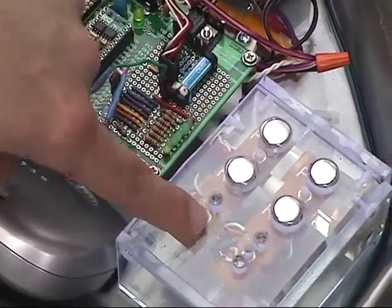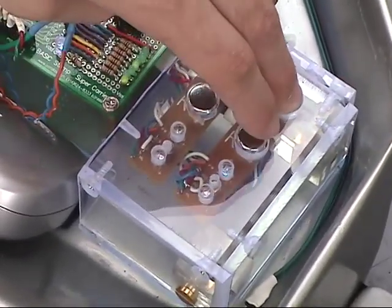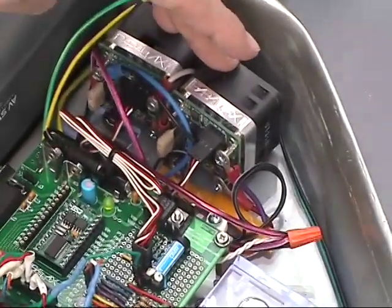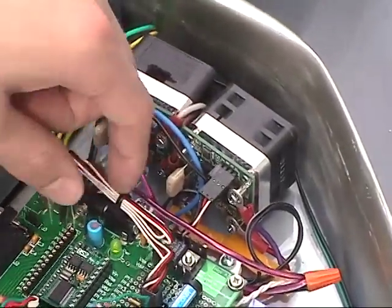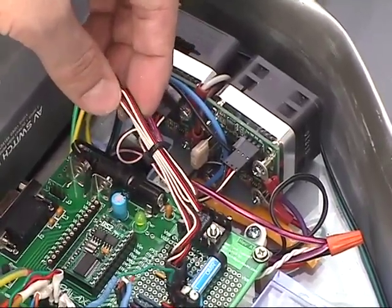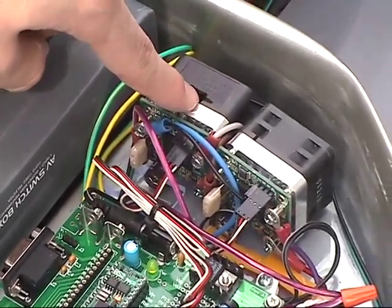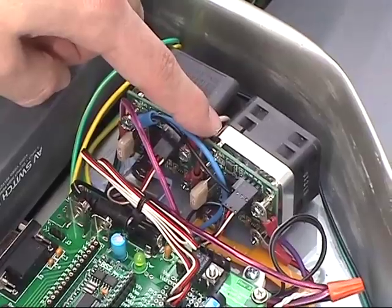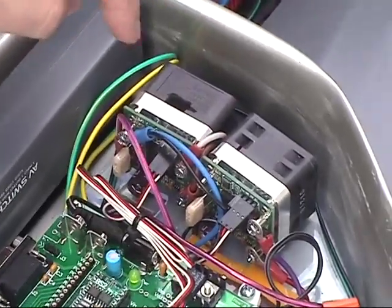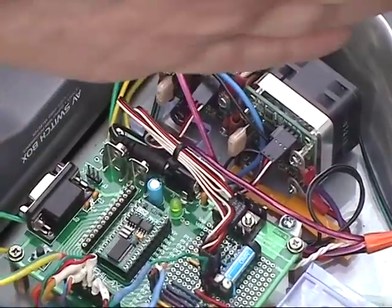I have LED feedback on those, so that when I move this here, you'll see the red light is flashing — and here the blue light is flashing on the way up. These are Parallax HB25 motor controllers, and they're communicating across serial communication with these black, red, and white wires here, and those plug in over here. Basically, these set the state of the motor and can produce some high-powered, high-amp outputs at 12 volts. It switches the polarity of the motor controller to bring it up or bring it down, and this has a timer circuit built in to take it up for the certain amount of time that it has to go.